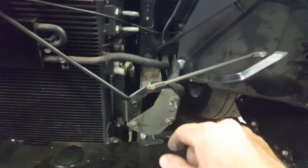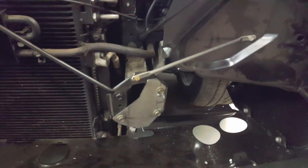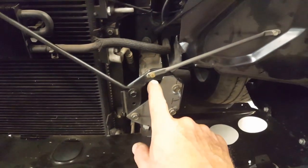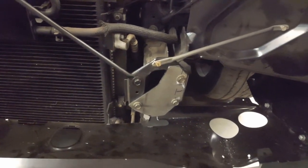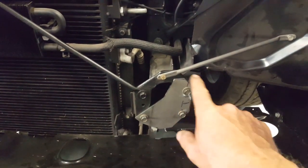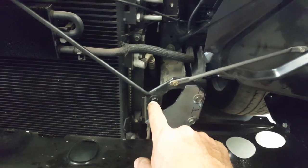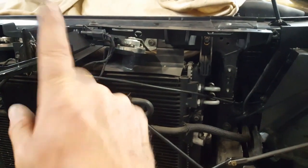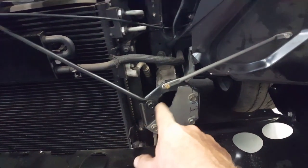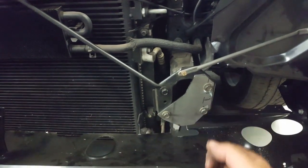For now I've got a piece of 3/8 tubing flattened on both ends with a couple of quarter-20 bolts and lock nuts on the backside, attached to the frame rail. I've also got a plate — I left one corner out of it so that the rod going up here that operates the hood latch mechanism can be dismantled separately from this bumper plate. Anyway, this bumper plate is the beginning of my bumper structure — that's just 3/16ths.